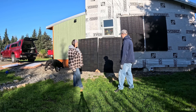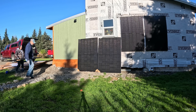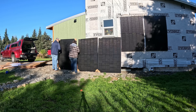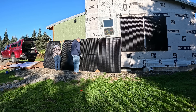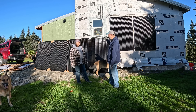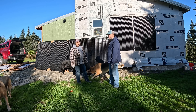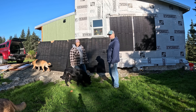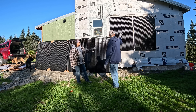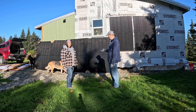We pulled a couple of them out and got them hooked up. We got them all unpacked and decided just to lean them against the house since the sun's out and hook them up to see if we'd actually start charging. In our last video we were only getting just over 70 volts with two panels — it wasn't enough to kick the charger on. Now we're bringing in up to 190 volts. The sun's not completely out and some are in the shade, but the battery is charging — that took care of our problem. We can now charge off the generator and off the solar panels.